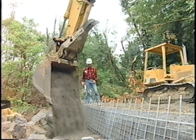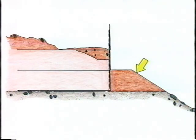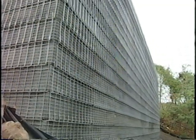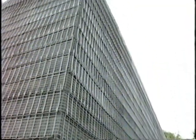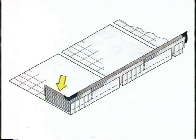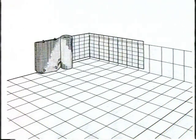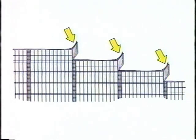Place the fill for the toe bury when you are at or above the third lift. It is very important to compact carefully. Continue the same process to the top lifts of the wall. The ends of the top lifts need corner backing mats to confine the backfill and prevent future erosion.